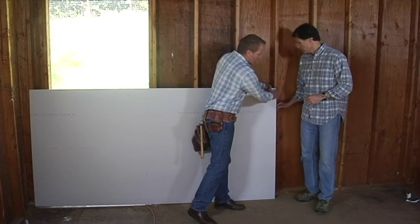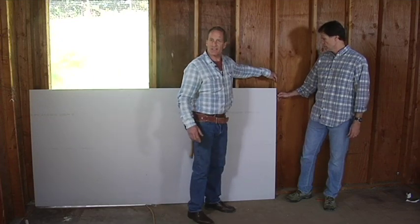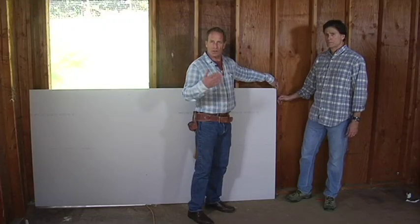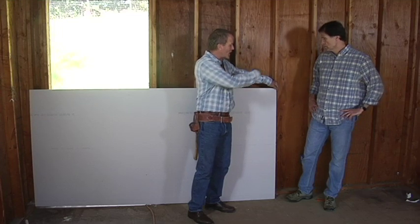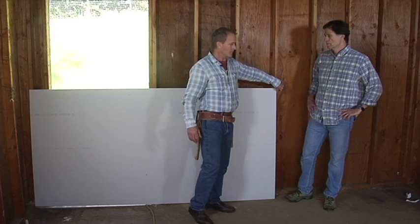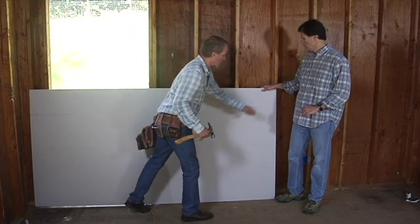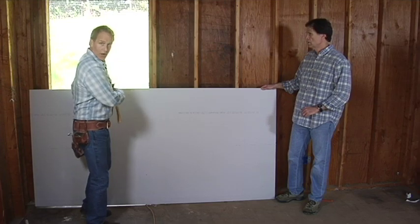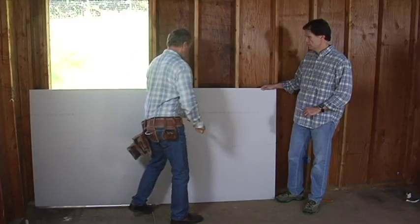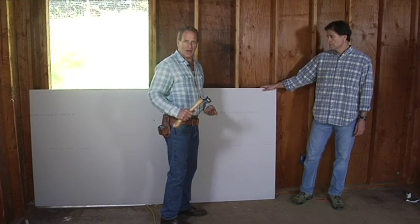What you see here is we're lined up to the center of this layout stud. It's eight feet right to the center of this stud, and our sheetrock is eight feet, so it's lining up nicely. What we'll do later when we fill this in is cut to the center of the stud to let the other piece of sheetrock in. I'm going to put some nails where the studs are and where the header is, dropping them down a little bit so I can get into the studs — that will give me a good idea later of where the studs are.